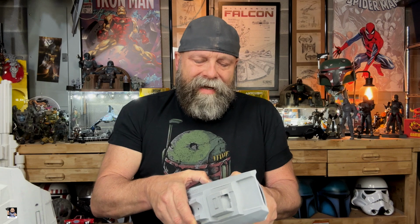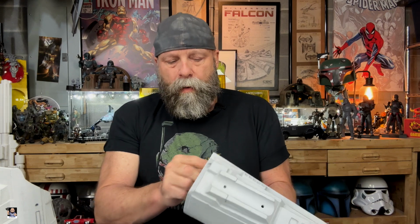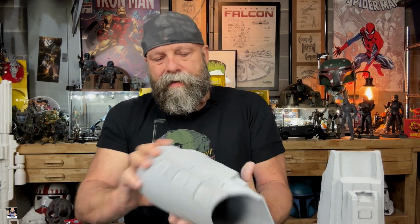But again, there's things that I learned that I would like to see if it would make it better. So first things first, when I did these, I did them at a 10% infill, which basically means that inside here it's 10%. And again, they work. I mean, there's nothing wrong with them. But I thought, wait a minute, I want them a little sturdier. Not this one actually, so we got a couple of screw attachments here. There's a piece that attaches here with screws and also here. And so I'm thinking to myself, if I have more of an infill density, that is going to make it even better. So that's what I'm doing.